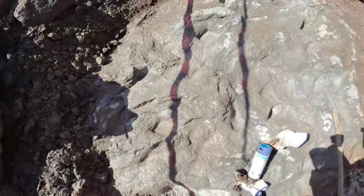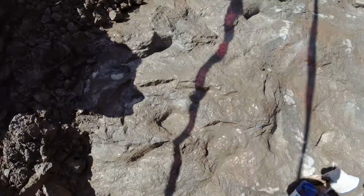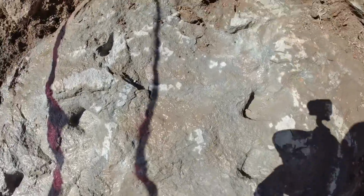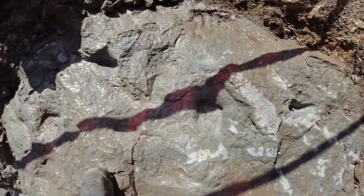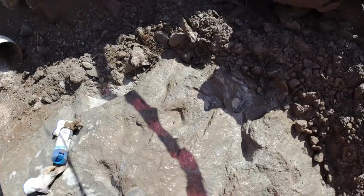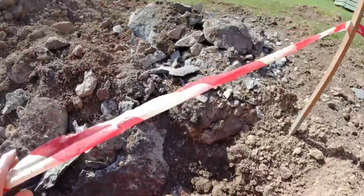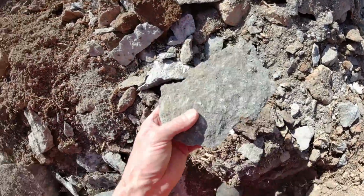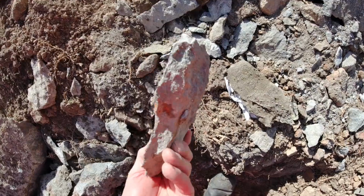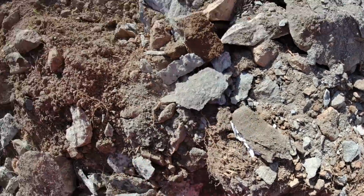Wow, they sure gave this rock a bit of a hammer massage with the breaker. I knew it would be like this, so I wet it first before I blew it down to clean it off, because it would just be clouds and clouds of dust going everywhere otherwise. Gee, I'd love to see the point on that breaker. This is Colorama rhyodacite, which is really hard stuff, and it wrecks breakers real quick. It's very similar to the Fernie Creek rhyodacite. The main difference, and how you tell the difference, because it looks the same, is that the Fernie Creek rhyodacite breaks pretty straight, whereas this stuff always sort of breaks ripply. And that's about the only difference.